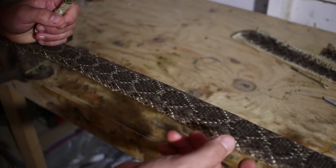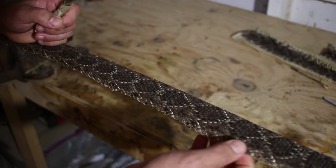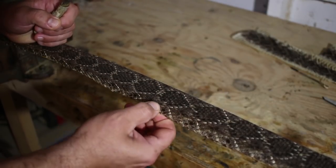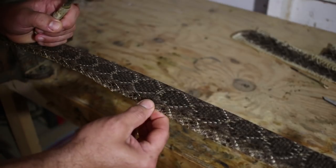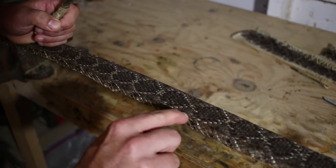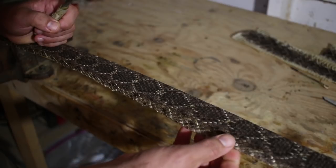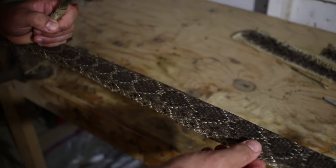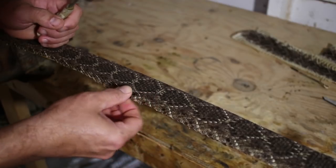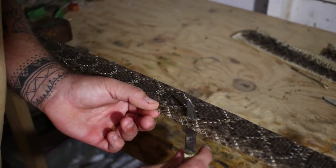Now it's the next morning. The skin is pretty dry — if it comes up really easily it's not dry yet, but if it makes a peeling sound it should be dry enough. Work the overhanging skin up carefully all the way along until you have maybe just a sixteenth of an inch. Don't pull it straight up to the edge or you could separate it on the back; we worked the glue line out really well so there should be good adhesion on the back but not the sides.